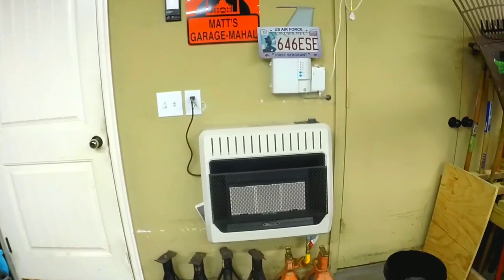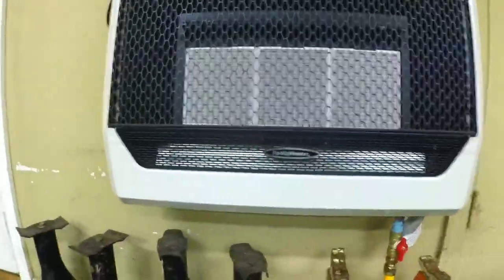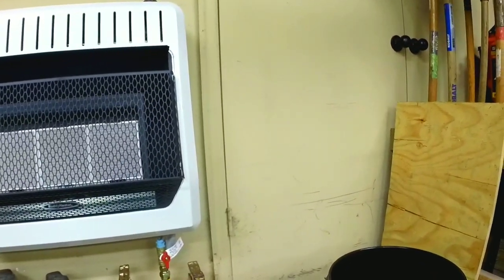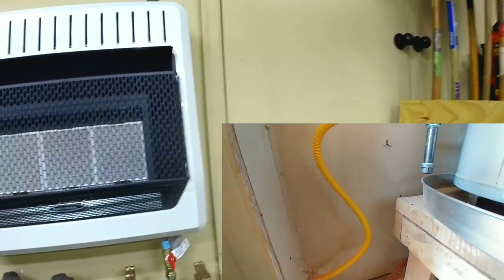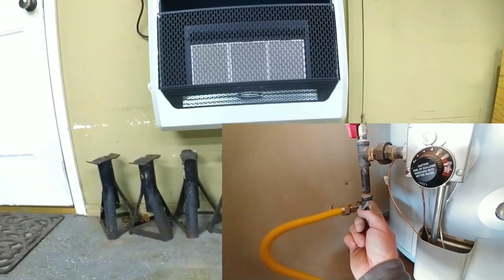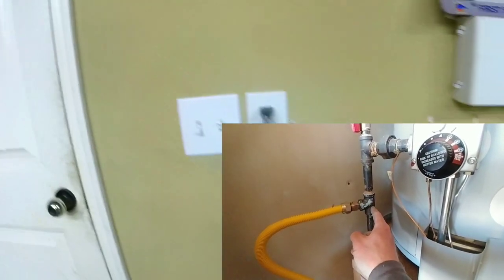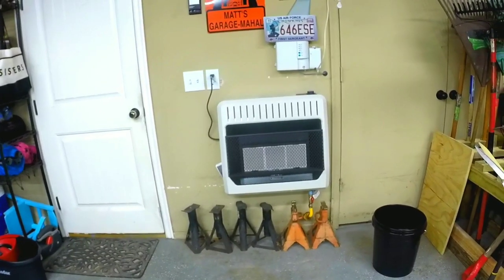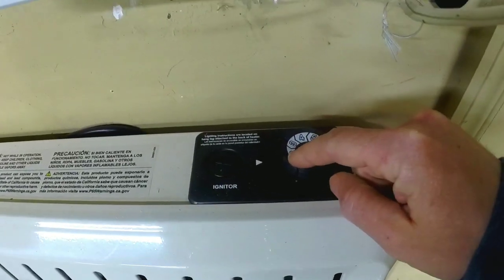So now we have a wall heater — a garage heater made by Ready Heater. It's actually made for indoor use and runs off natural gas. All I did was tap off my natural gas line, drill through the wall, and run the gas in there. The only electric component is the fan for forced air. It's a 30,000 BTU heater — about twice as much power as I actually need for 400 square feet — and it's really comfortable in here. I could wear a t-shirt and feel just fine.